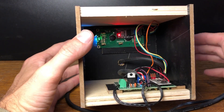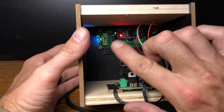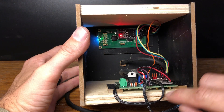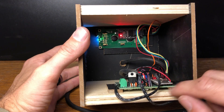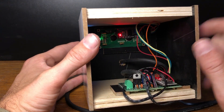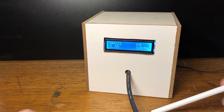I've just got everything mounted in here. I put it all together with superglue. The LCD screen is up inside there — I put some shims under it, mounted it in, and superglued it all together. Same thing with the chip board — got it all glued in here. The back comes off so I can access the Arduino if I have to, in case I need to change something. I've got the probe stuck through a hole in the front so you can use it to measure a pickup.